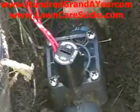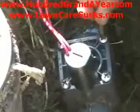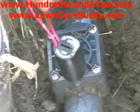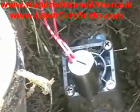So now I'm going to take a screwdriver and I'm going to tighten the valve down the same way that you would the lug nuts on a car tire. We're going to go opposite from each other so that it seats correctly and we won't have any problems down the line. Now, the next thing I need to do is connect the wires back up.